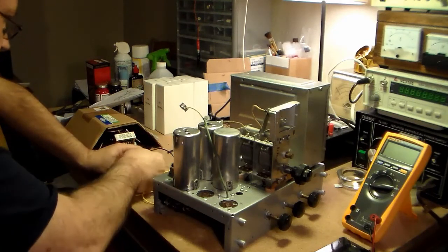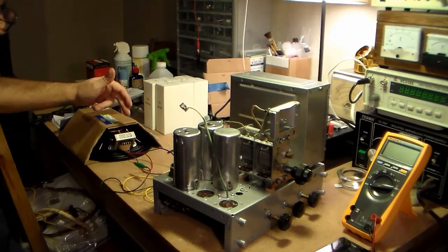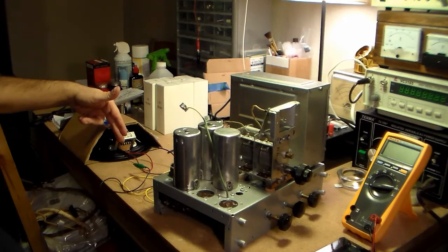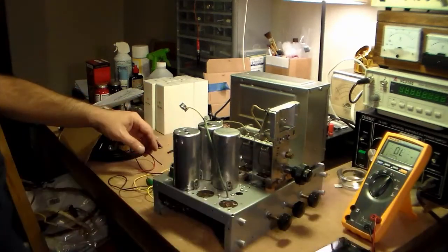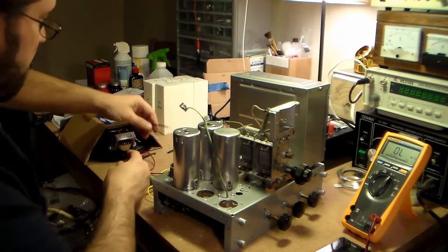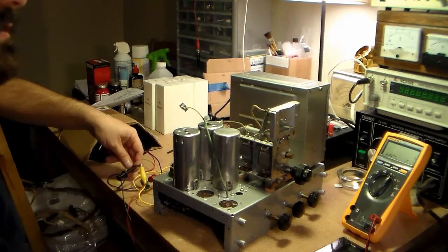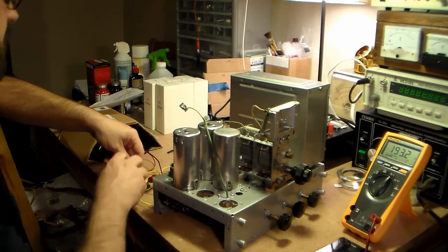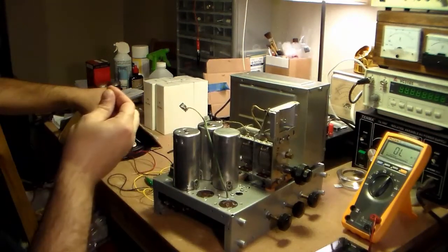One of the concerns I have is, same thing on the other transformer. The ohms between the primary on the Philco transformer, it should be 680 ohms. This is 190, actually, I believe. Let's double check that. Which concerns me. I mean, the voltage is going to be a bit too high. So yeah, I got 193. I guess I'll deal with that if it's much of a problem.